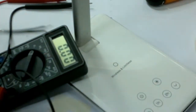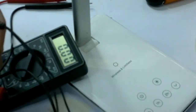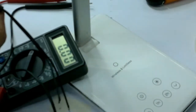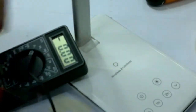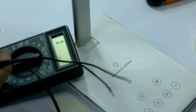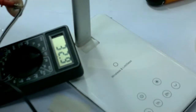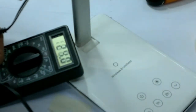This is the negative and this is the positive — the short one is the negative and the long one is the positive. We will also have to check this wire here: which side is which, and what is in the middle. Continuity test. Okay, the short one is in the middle, so that will be on the positive.